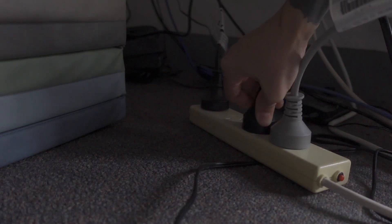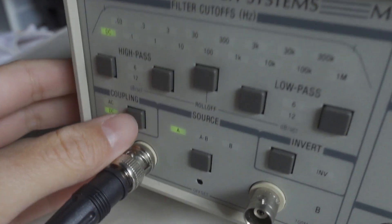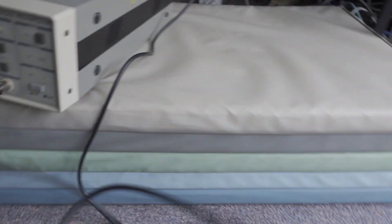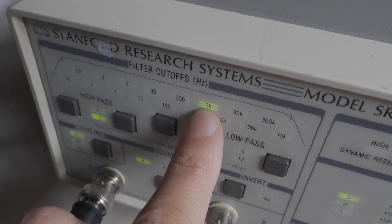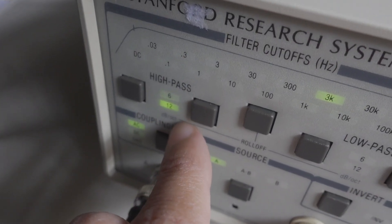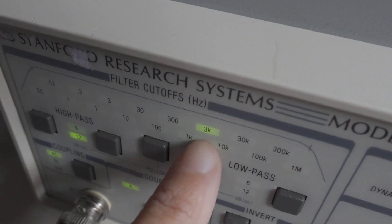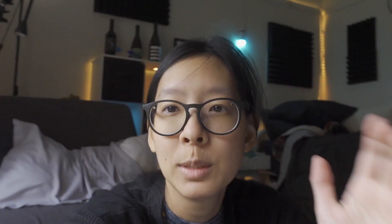And then you just start plugging them in. Alright guys, here's what you do with the amplifier. First you need to AC couple this thing because the photodiode outputs both DC and AC. Then you want a high pass filter making sure you only hear the noise that is generated by light from the photodiode. My high pass rolls off at 12 dB per octave, so it's a pretty steep rolloff, and I got a 3 kHz zero. You want a high dynamic range and the gain depends on your environment — it's pretty bright in my room so I'm only setting the gain to 50 for now.